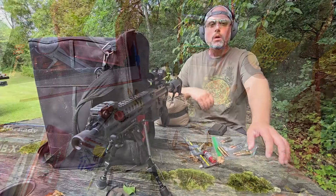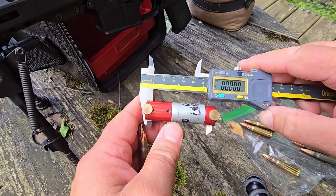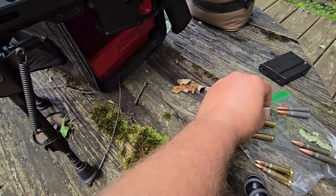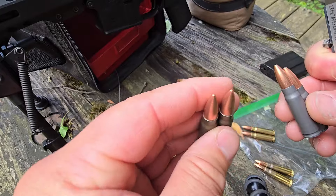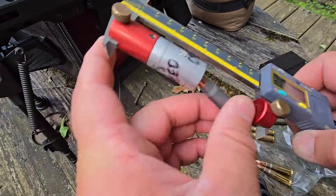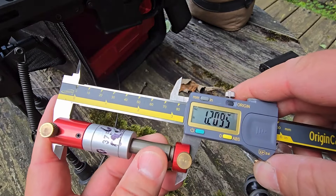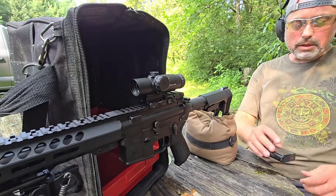Getting back on the reloading bench: measuring the unfired brass case lengths. The Belum brass is 1.212 inches, the Federal is 1.210 to 1.211. The Wolf full metal jacket has more of a greenish color casing where the hollow point has more of a gray color — just so I can keep track. Overall, these cases are averaging between 1.210 and 1.212 before fire forming.